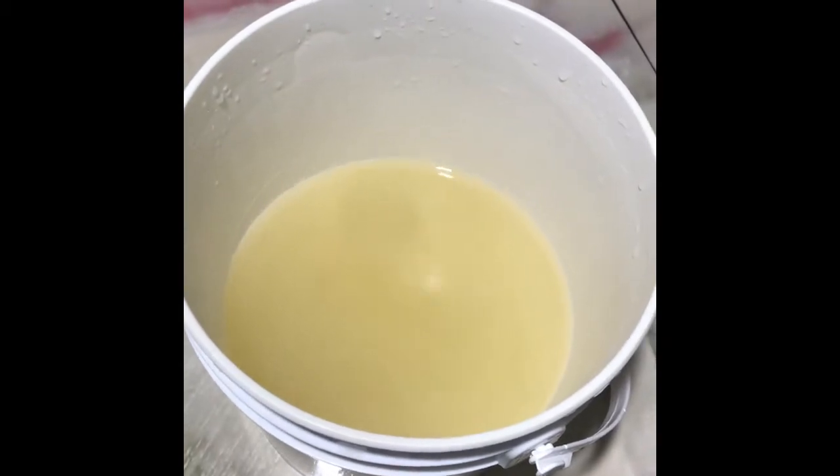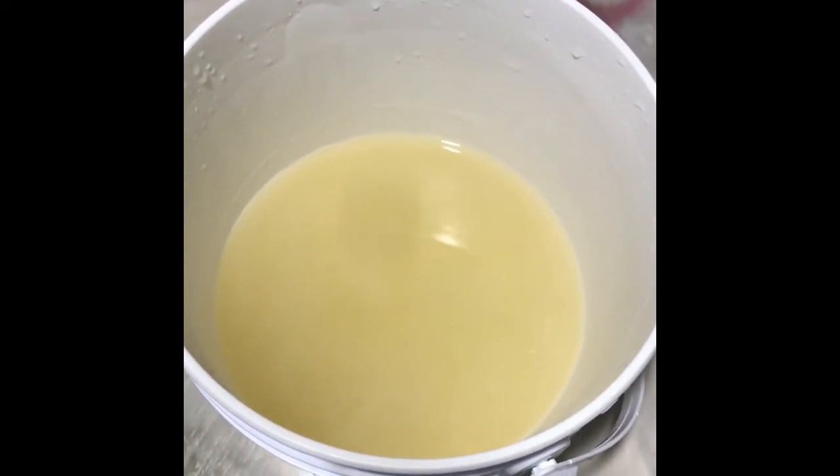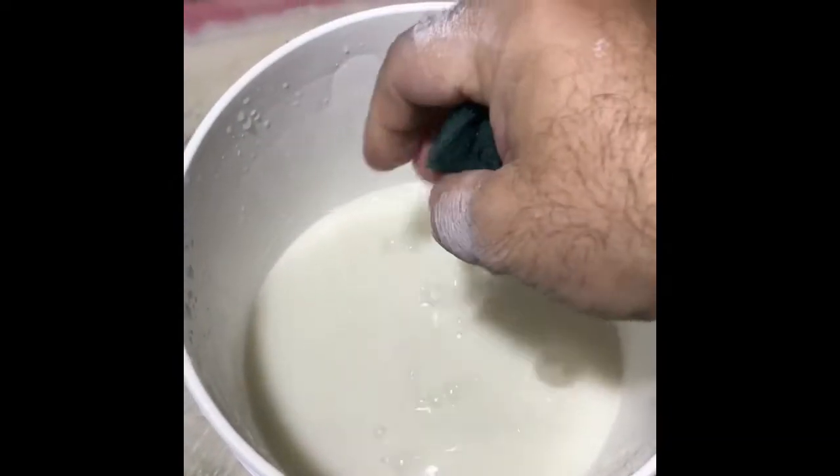What I noticed when you first start scuffing a particular section is it feels rather smooth — like there's a gloss there which you can see. But as you continue the scuffing, you can feel the friction; it's not quite as easy to scuff, and I think that is some of that bloom coming off. This is the bucket of water that I used to scuff my wing. Whatever's come off the wing, there must be some particulates in there in addition to stuff which is water soluble, because as I move this around you can see all those particulates moving to the surface. So all that was removed through the scuffing method.